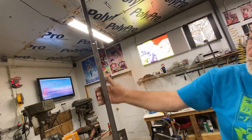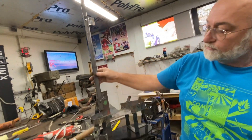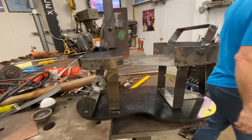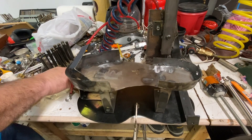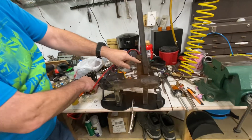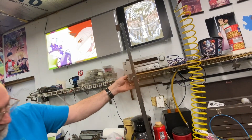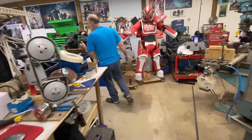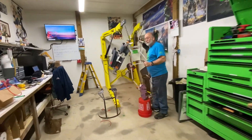I've been working on the legs here — as you can see, got up to the waist pretty much built, working on the joints and the cylinders. Over here I got one set up. Same thing, I got the pneumatic cylinder on it. You can see the end of the cylinder. Basically you cycle the thing, you can move the joint, cycle it back, wiggle the joint, it locks again. That's how that stuff works for all of them.